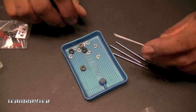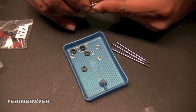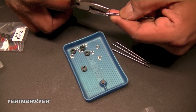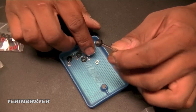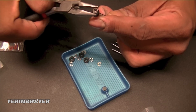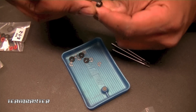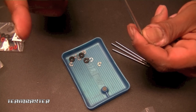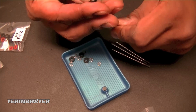The first step is to assemble the shafts. We have four shafts and about eight tiny little E-clips. The E-clips go around the shock shaft and snap on there. The piston sits right on top of that and then it gets bound in by another E-clip. The E-clip sits on top — you take your needle nose and pop it down in. After a little practice you can pop those on pretty easy. Those E-clips like to go springing across the room, so it's a good idea to have extras on hand in your hobby toolbox.